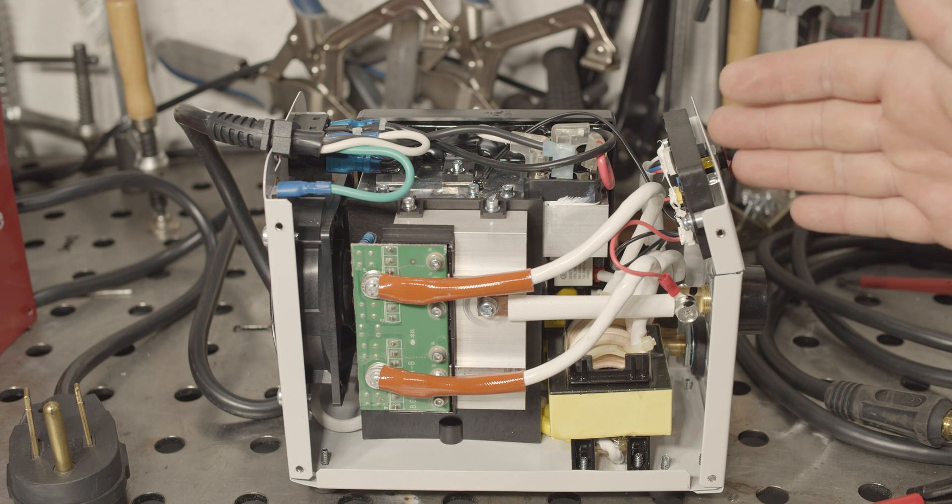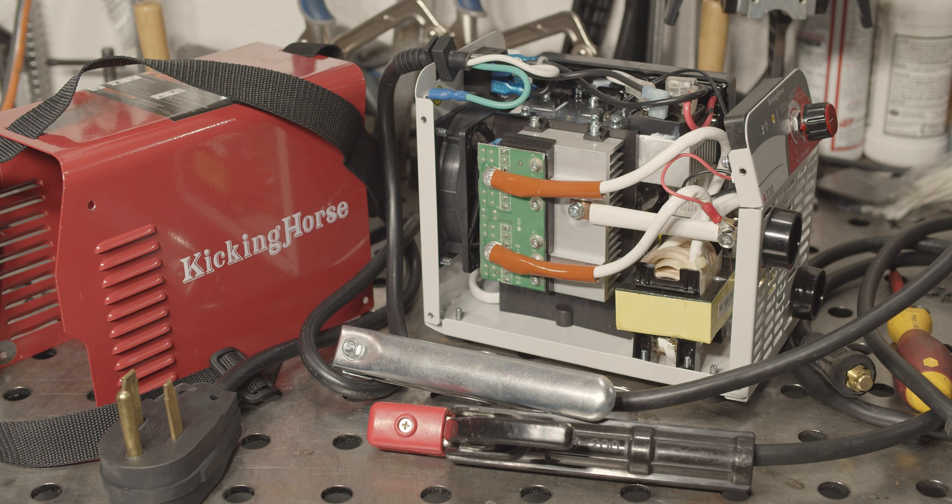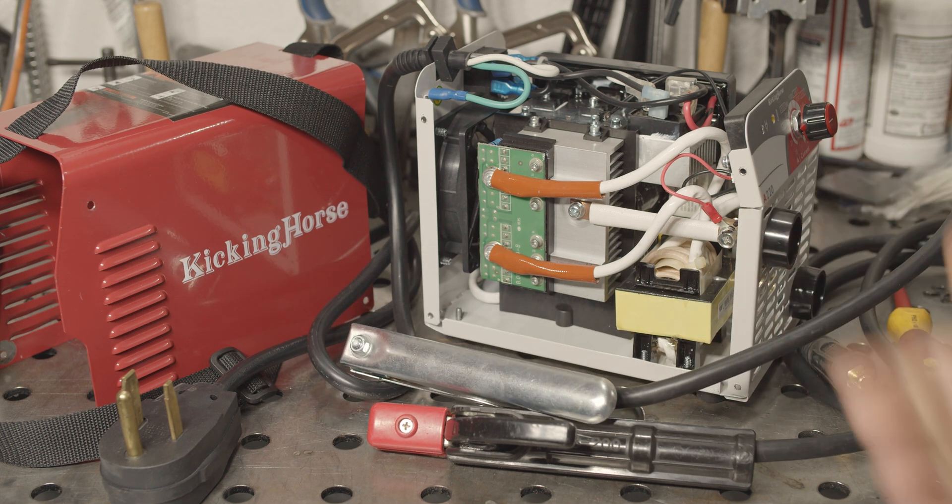This welder is 240 volts only, designed just to work on 240 volt input. Kicking Horse also sells a 120 volt powered version with 100 amps max output at a 30% duty cycle — same size, and based on pictures on their website, the internal build looks pretty much identical. This isn't the cheapest welder out there at $259, but it is relatively cheap for a 220 amp welder if it can really do 220 amps. The cables it comes with have aluminum conductors with the kind of crappy insulation a lot of these welders come with, and are just under 5 feet long. Combined with a relatively short power cord, there's a fair chance you'll need an extension cord.